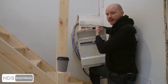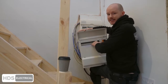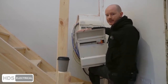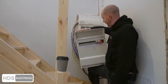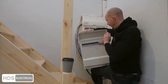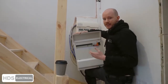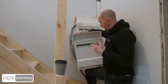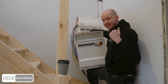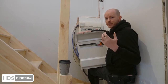The other great thing is spare ways. When we take the cover off you'll see they've crammed five circuits into one breaker, which my governing body said was a C2 — it's so badly overloaded. Losing all the lights in one trip is just silly when you've got spare ways available. Finally, particularly because this is a more rural area, we've fitted surge protection. It protects from lightning strikes and transient voltages, which is critical when they have an expensive AGA and expensive air-con heating machines — a surge could blow all that equipment and cost thousands.